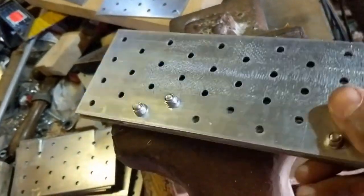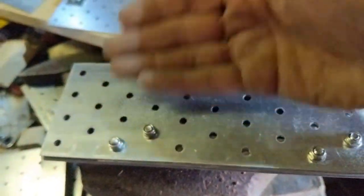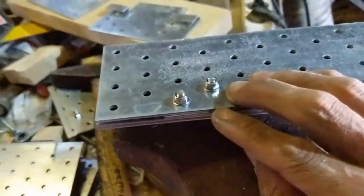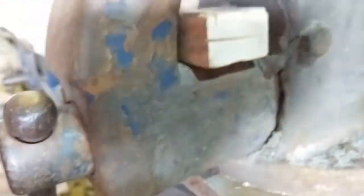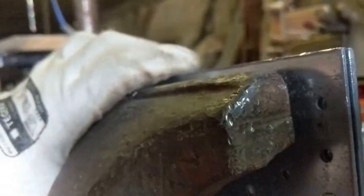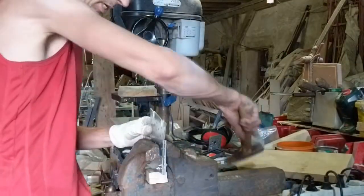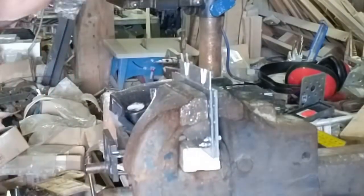The bending tool uses two sheets to make it more durable, and one sheet on one side. The two screws on the upper part act as a stop so I always get the same height. There's a little sheet of plastic in between so it's easier to slide in. I've made two possible heights — one and two — to easily fit the piece inside.